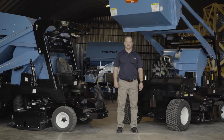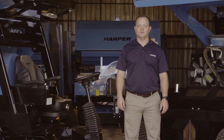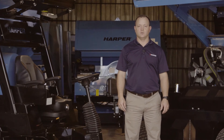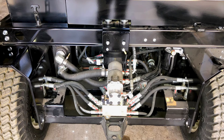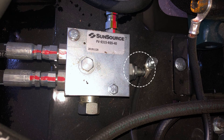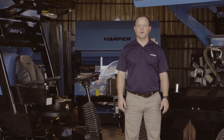At times the loop flush valve may need to be adjusted. Situations that require this would be: while the machine is running you hear a high squeak or whistling sound, or while going forward or backward you get a lunging forward or back motion when you step on the pedal. To adjust the loop flush valve, go to this location and turn it in a half turn. If this does not resolve the situation, continue to turn it in half-turn intervals until it is resolved.